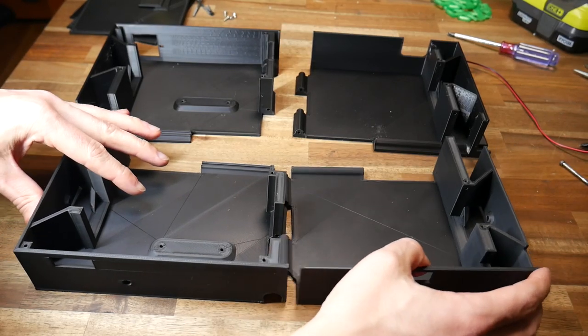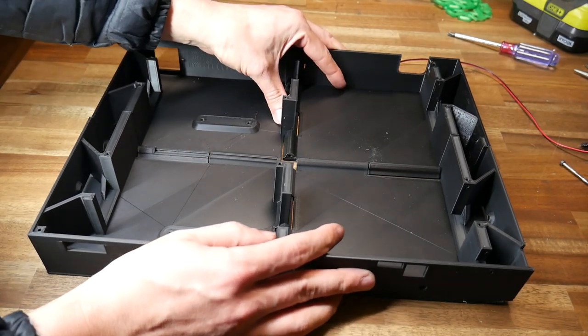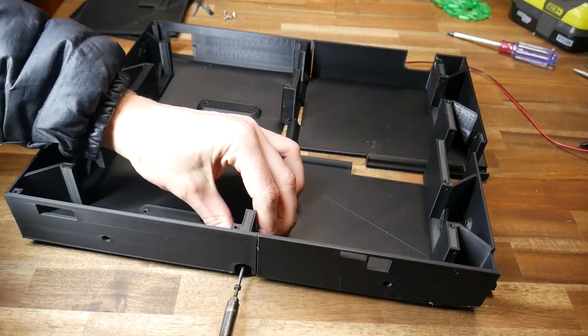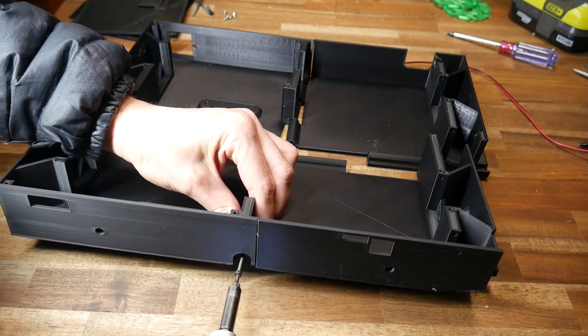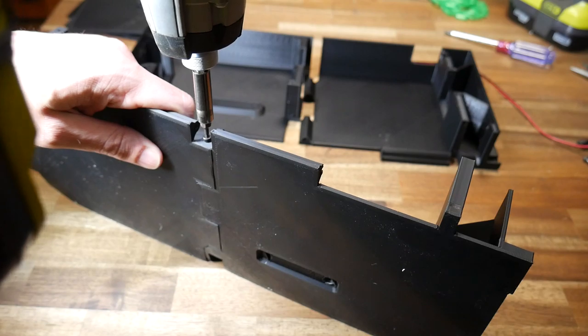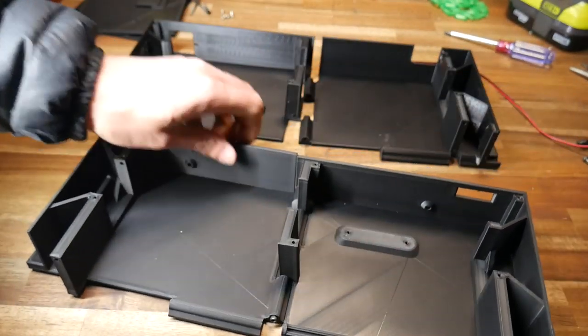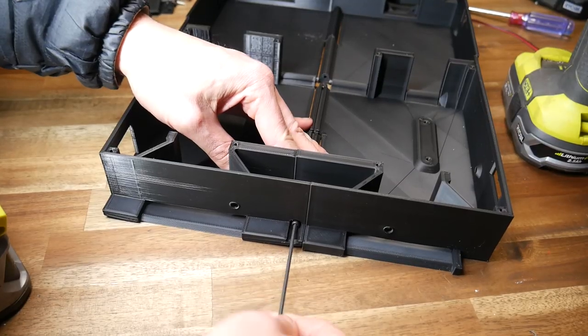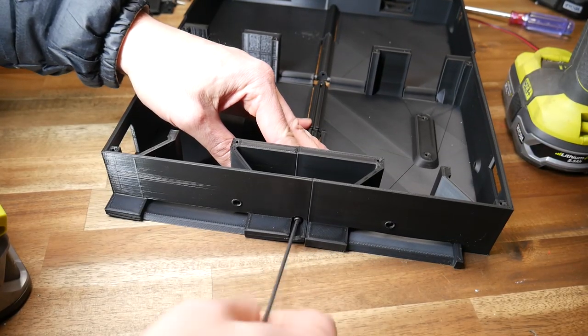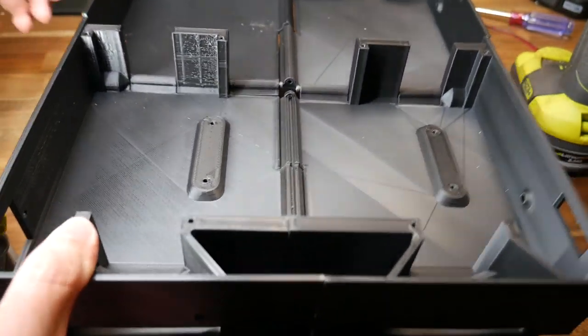Here are our four base pieces — they're designed to jigsaw together, and my designs on Thingiverse are slightly more refined than what you're seeing here. Each pair is designed to be held together with long M3 by 50 bolts. When you join the left and right pairs, there's actually room to have one of these bolts on each side. Introducing them will make it fairly rigid. You can then join the front to the back pairs with the exact same M3 by 50 bolt — the more we do with this case, the more rigid it will become.